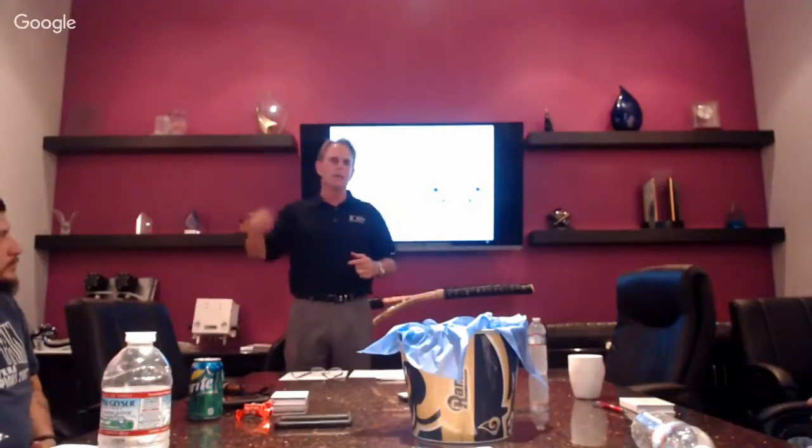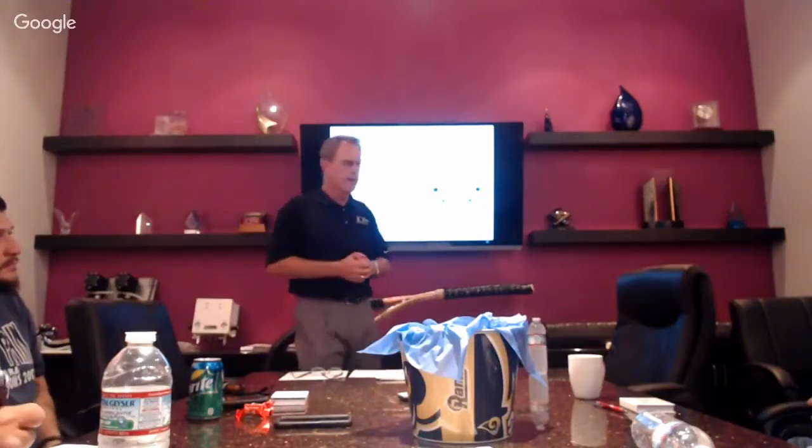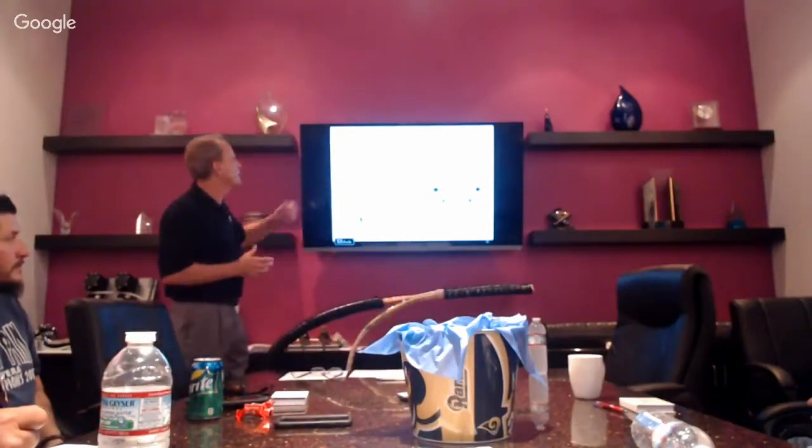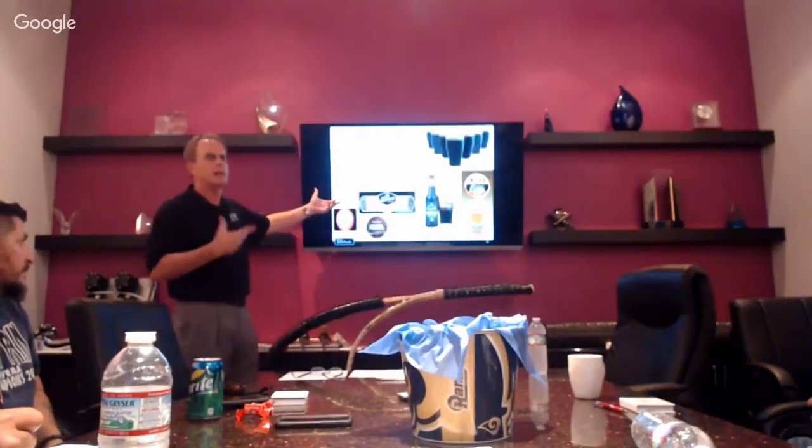Beer systems are best in dedicated keg walk-ins. The problem with half keg walk-in, half food walk-in is people are in and out all day long. They're warming up the walk-in because they don't want to screw up the produce. And now all of a sudden you've got kegs at 42 degrees and they're blowing foam. So most of the new construction generally have keg coolers, not always. So that's the CO2 mix. That's the blender, and then that was a nitrogen generator that we can actually provide.